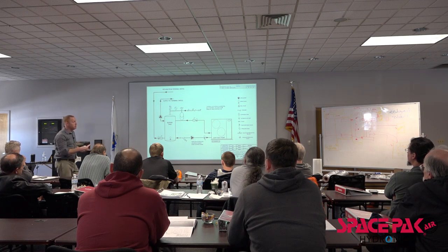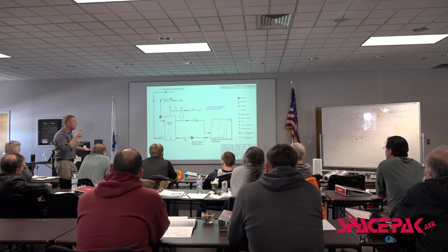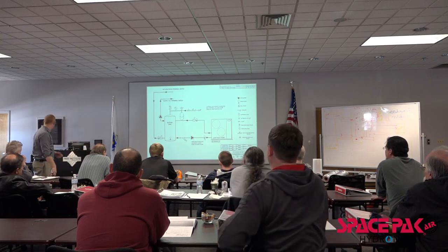Again, it's a boiler system, a low pressure system, 12 to 15 PSI, just like a boiler system, just like any other hydronic system. So we need expansion, we need water feed, and potentially we need glycol makeup systems, depending on what's required in your area.